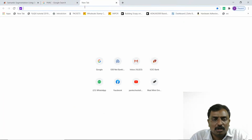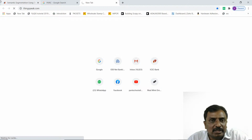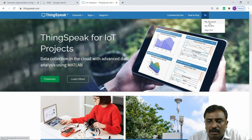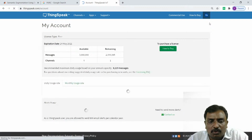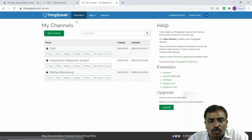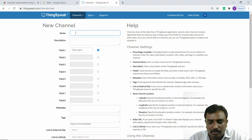Okay. I will log into the ThingSpeak account and show you the same thing on the cloud. You just go to thingspeak.com, click login. I have already logged in. So go to my account, then channels, click my channels. These are all the channels we have in our system, like the automatic diagnostic system as well as the weather monitoring systems. You could create a new channel by clicking this icon, new channel. Once you click new channel, you give a name; we are going to do a cloud-based weather monitoring system.